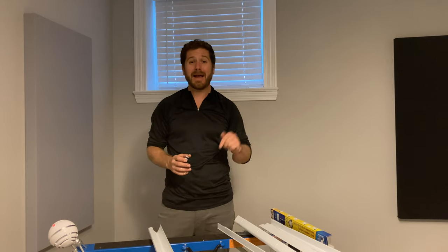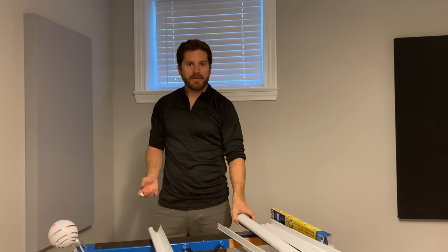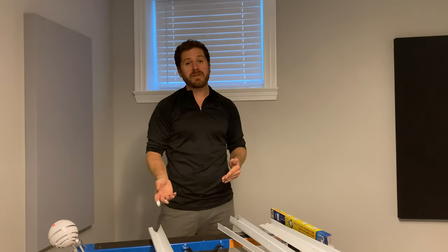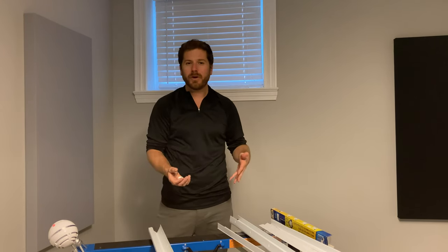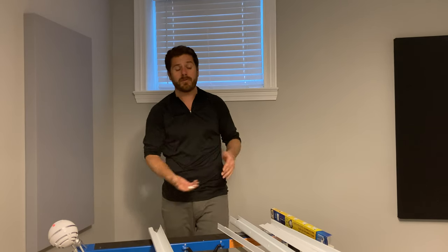That's an easy way to bring your heating and cooling costs down by spending just $10 to $20 on a door sweep. I'd suggest using the caulking for exterior door sweeps — for interior doors it's not really necessary since water getting in between the bottom of the door and the top of the sweep isn't a concern. Hopefully you enjoyed this video — leave any comments or suggestions for future videos below. Thank you very much for watching, until next time.